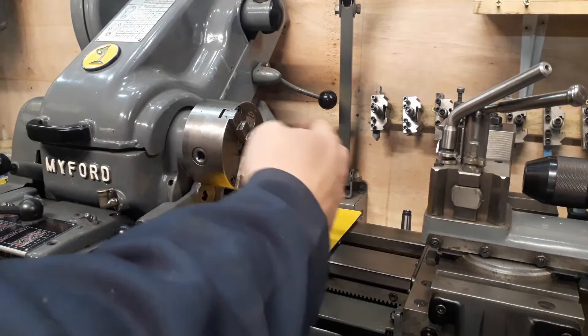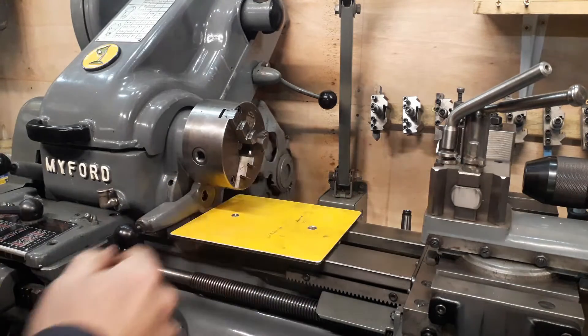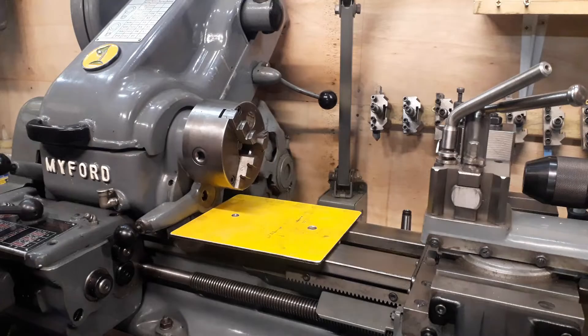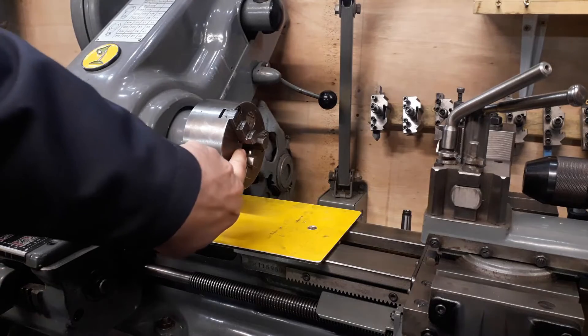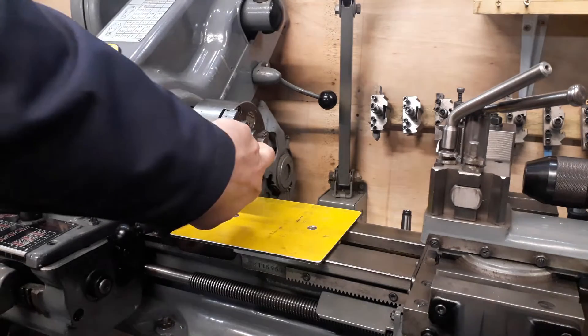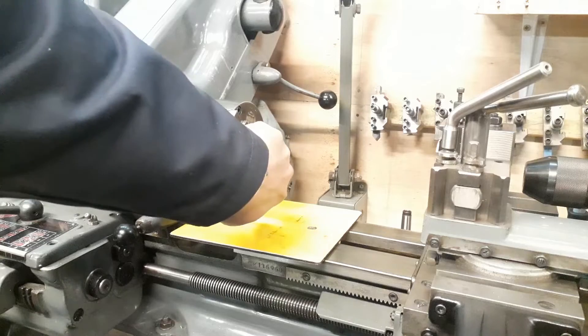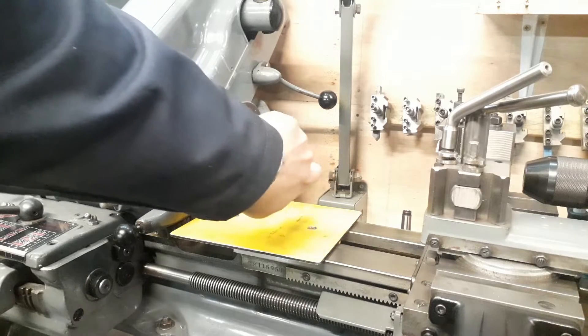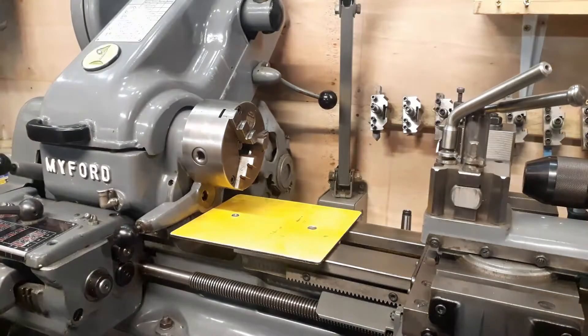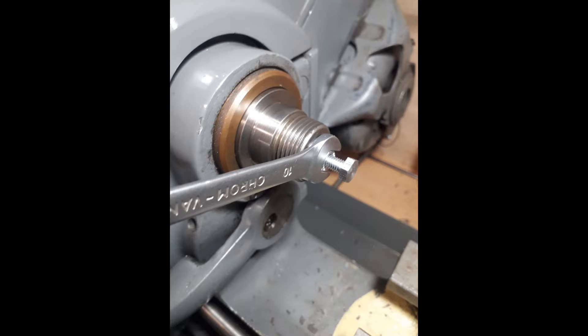Back up — using the method we showed you in the other video with the piece of stock. Just for this demonstration I'll do it like that — not too tight. Now I'll show you close up in a minute. You've got a little M6 bolt with the end machined off, so you can use that as your depth stop, putting all your parts repeatedly in the chuck. To adjust the depth, you simply use a spanner to unlock the first nut, adjust your bolt to whatever depth you need — obviously with your chuck in place — and then just lock it back up again.